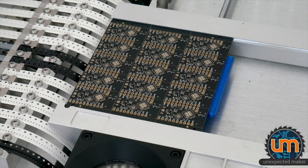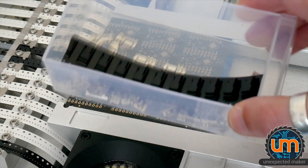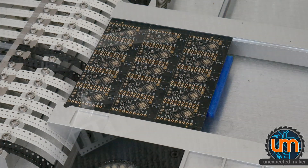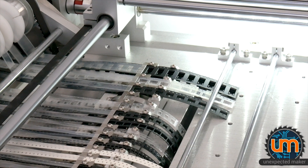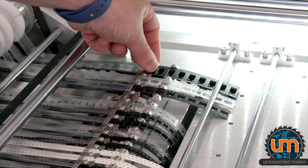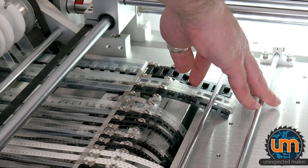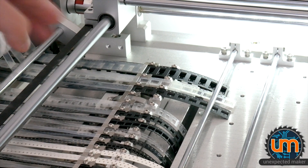Here's another board that's on my pick and place machine, ready to go. Two of the components I'm running low on are my Pico D4s and my ProAnt antennas. I do actually have a whole bunch of loose ProAnt antennas, and I've had a whole bunch of loose Pico D4s, either on small strips of tape or just loose in a container. So what I've been doing is, as I'm feeding new panels onto the pick and place machine, I am manually taking my spare parts, reloading them into the tape, and then feeding them backwards — sometimes one at a time, sometimes two or three at a time.